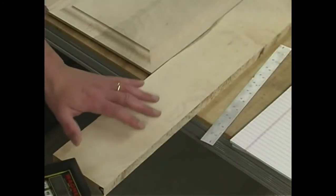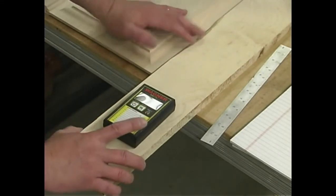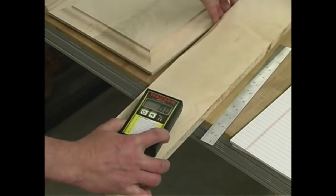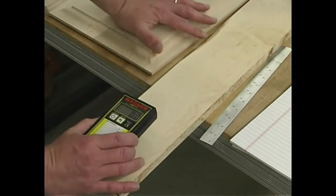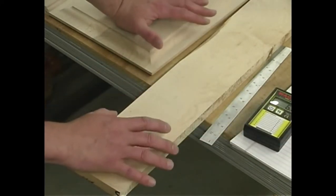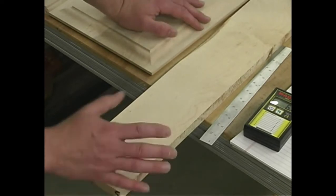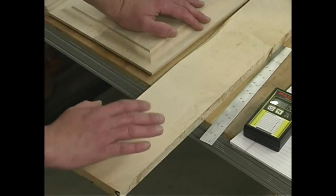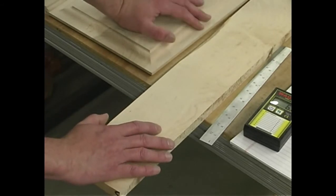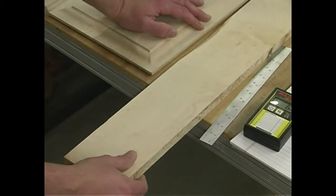Now the material that I've got on hand, the moisture content of it right now is at 7.7 or 7.6%. This is where a moisture meter comes in really handy. In my house right now, most of my hard maple pieces are at about 7 to 8% moisture content. All pretty relative. It's also in our seasonal change here right now. We're in the springtime, so things are not quite dry and not quite humid yet. They're in that transitional period.